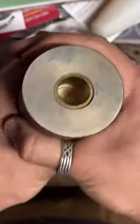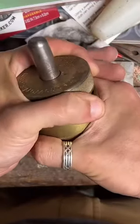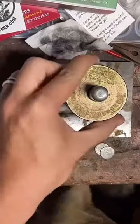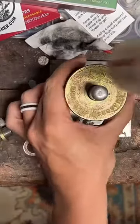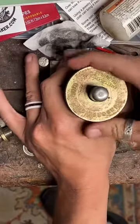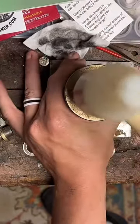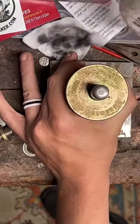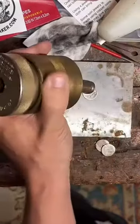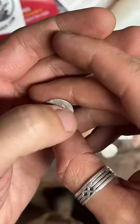Let's check here — see, it looks centered. Maybe I've got to make sure this is nice and tight. Use my press. It's coming loose a little, so we'll tighten it back down after every hit. Looks a little better. Still getting this weird chipping. I may have to lube up this punch.